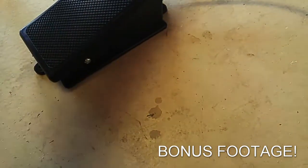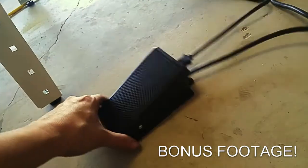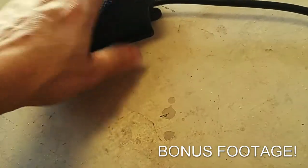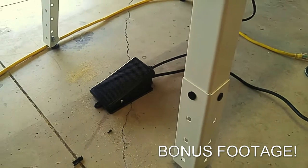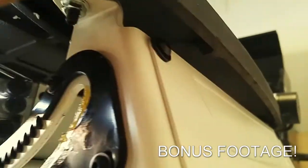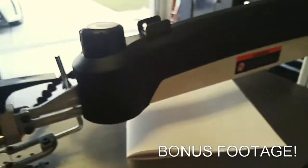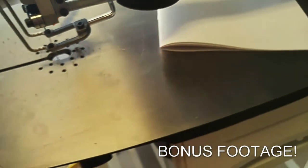One thing that was annoying me about the foot pedal was that one cable went in through the side and the other through the back, and the side one always wanted to spin on me. So I plugged up the side hole and moved it to the back — it's much better now. I can leave it in the front, it stays straight, and I can keep the cords out of the way. The other thing I said I was going to do — and actually got around to doing — was adding a rubber washer between the table and where it mounts to the tool. I definitely think that has reduced a lot of vibration on the table. I lost about a sixteenth of an inch in height, but I think it was well worth it.